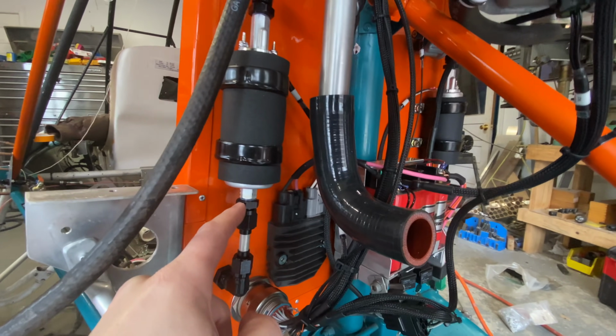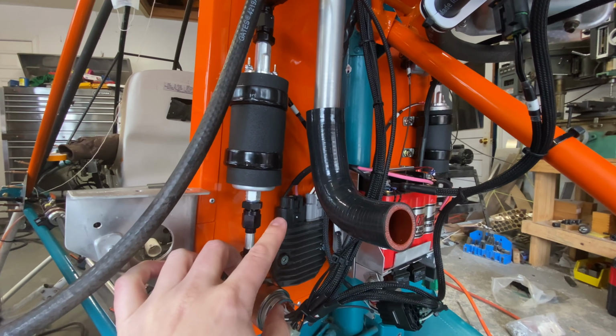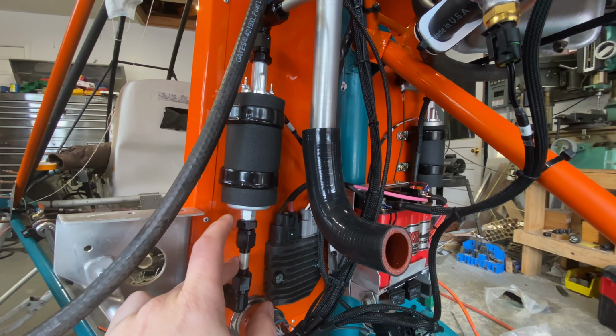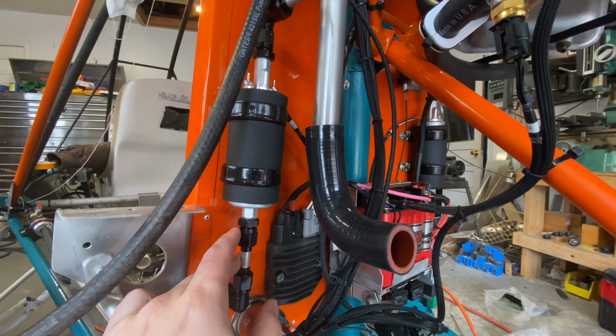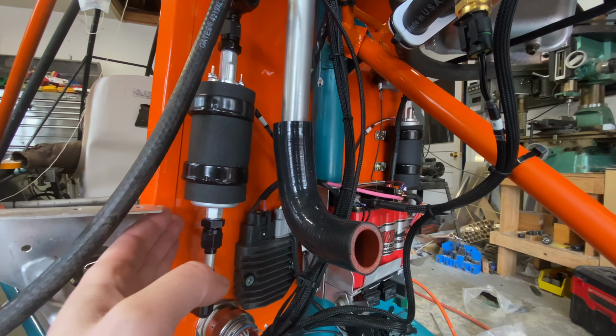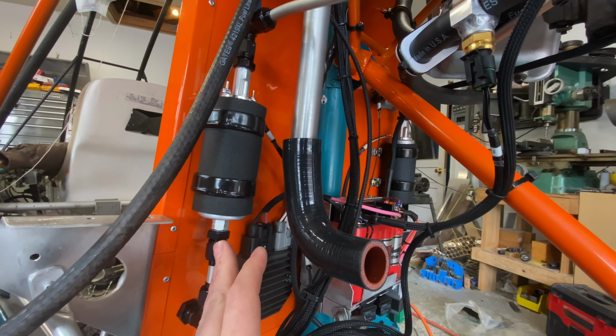I had, I think one of the 4, because there's 2 per pump, one of the 4 leaked and the others I had a feeling might start weeping. But the kit that came with them actually supplied these plastic washers, which I had discarded thinking metal would be better, and I was wrong. So we've swapped them back for plastic washers. They're now all sealed up.